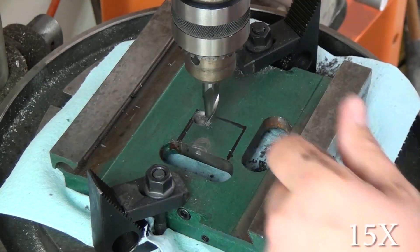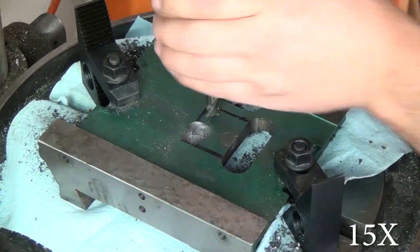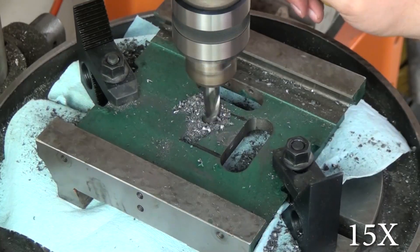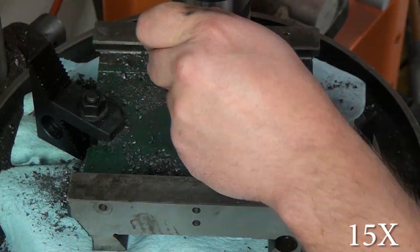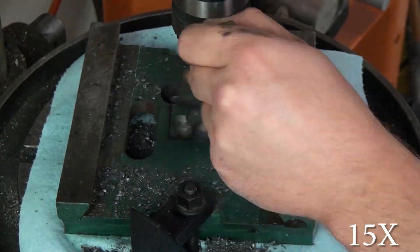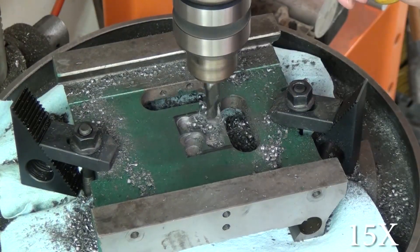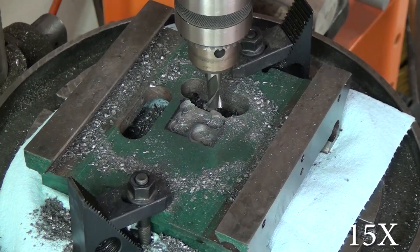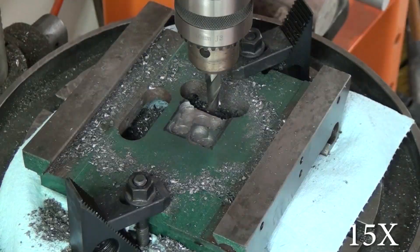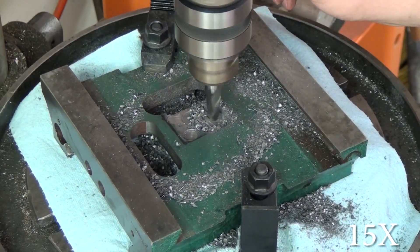If you're going to be upgrading to ball screws you're probably gonna need to do some clearance work on the saddle like I'm doing. The ball screw nut is too big to fit between the saddle and the table, so I'm taking about two hundred thousandths out of this little area. All I did was leave the ball screw and nut on the saddle, trace an area around it, and start to plunge with the drill press. This is not the most elegant way to get the job done, but it doesn't matter — you're just trying to get material out of the way so the ball screw nut will fit. If you have an angle grinder, die grinder, or anything that'll cut metal, that'll work too. It doesn't have to look nice, you're never gonna see it again. I still had to clean it up with the die grinder though because it did make a mess.